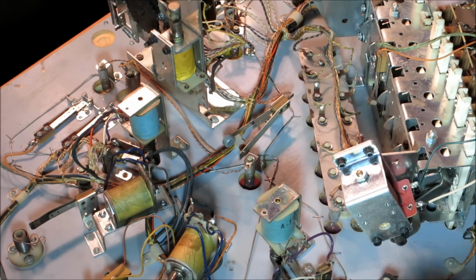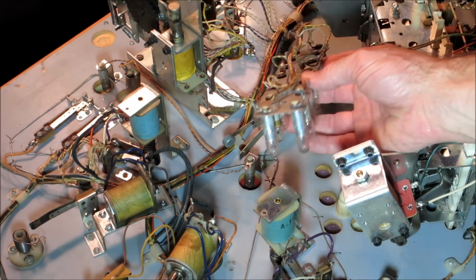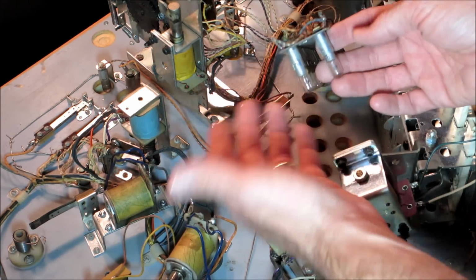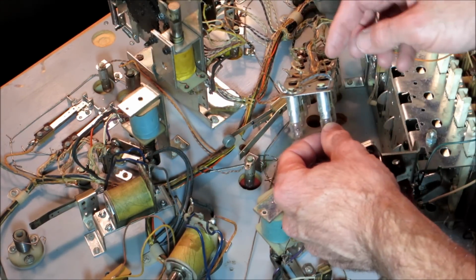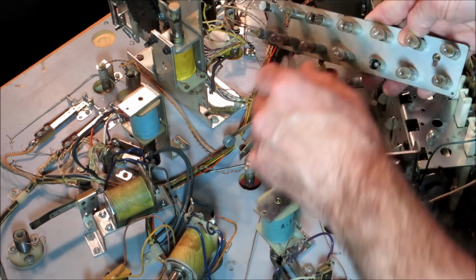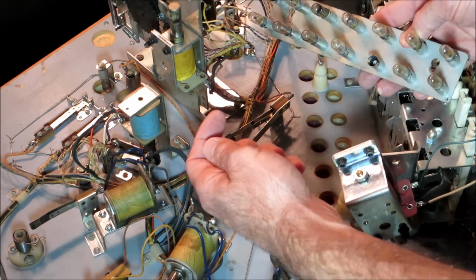Let's take a look at some light bulbs. Alright, so these are press fit together, and over time they are going to cause some issues. And I hope you can see there's a little black insulator right there. So a light bulb is basically a really small coil, so it's going to need voltage across it. One part of the voltage comes in on the wire into this tip, and then it goes through. Let's see if I can show in the camera. Yeah, see that little silver piece in the middle? That's actually mechanically that tip. And then the outer barrel of this light bulb is the other side of the voltage.